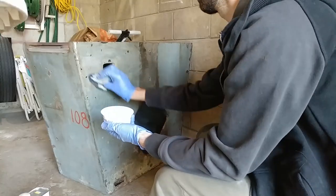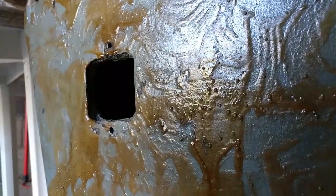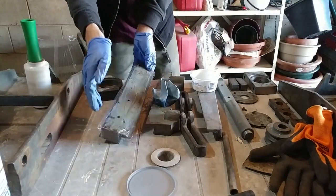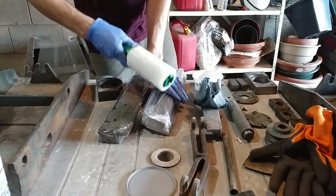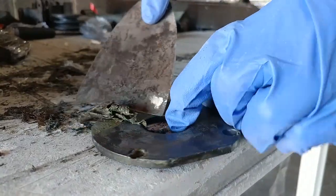I first tried to use a chemical stripper known as Super Remover Automotive Stripper. You put it on fairly thick, wrap it in saran wrap, and then the paint should scrape right off in 12 hours. This wasn't quite as straightforward as I'd hoped. First off, the odor was a little intense and it gave me a headache pretty quick. Second, the paint was very thick over the cast-iron base and some of the smaller cast parts too. It seemed like the stripper could not penetrate deep enough and I would only be scraping off a fraction of the entire depth of the paint. They used a pretty thick lead-based filler over the cast-iron parts to fill imperfections. A few of the smaller machine parts that didn't receive any filler — the paint came off like a dream.